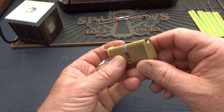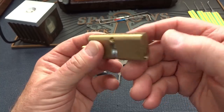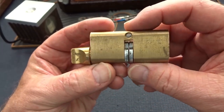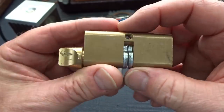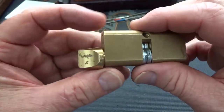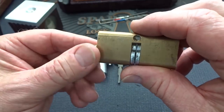Let's start with this guy. This looks a lot like a Euro lock, but it is not. This is a copy. The shape is wrong, the assembly is wrong. This is actually permanently put together — it's almost like a disposable lock because there are no circlips in between. You can't take it apart. Assembled at the factory, sometimes it's keyed on both sides. Other times, like this one, you've got a thumb turn for the inside.